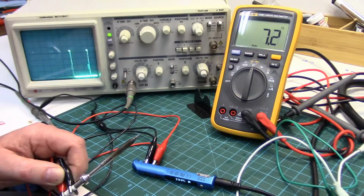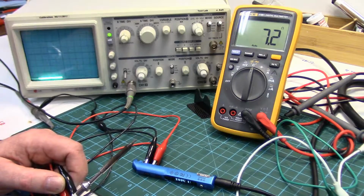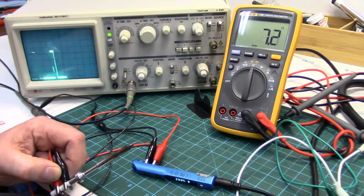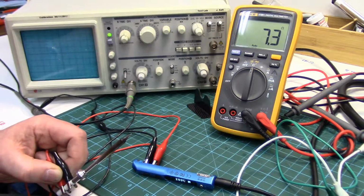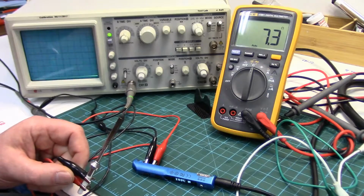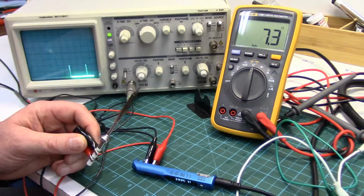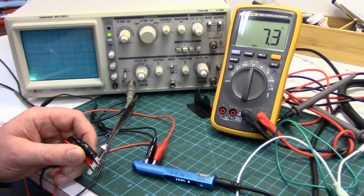When you look at a regular iron, it's on and then it's off, and the frequency isn't as tight. It doesn't react nearly as quickly. So you can really appreciate how quickly these do react when you're actually looking at that voltage come on, and then how it's keeping that tip absolutely at the right set temperature. It's pretty impressive. So it's just a quick little boring video, but if anyone is kind of curious how these integrated or cartridge style tips work, it looks like the heating element works as both the sensor and the heater.